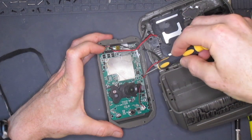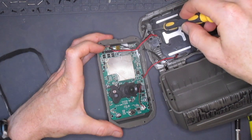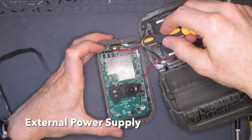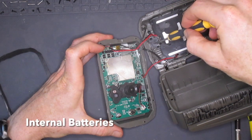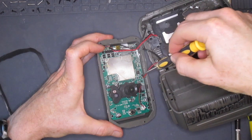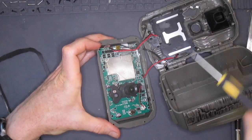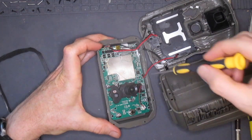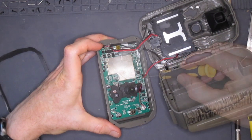The bottom cable goes off to the microphone. This pair of wires is for the external power supply adapter. This one goes to the battery case. And finally, this pair goes to the IR LED array. One of the things I noticed is that these wires are simply soldered onto the circuit board without any type of removable connector. These types of connections can be sources of failure due to cold solder joints.